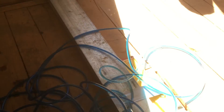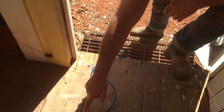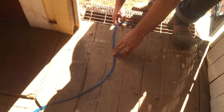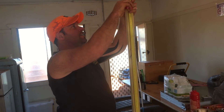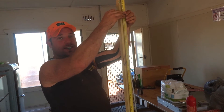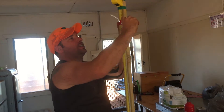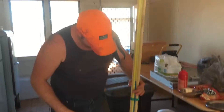Slowly but surely it's running down, running around, and it will keep doing that as long as we're lower. And here it comes now, down the end — you can see the blue coming along, and here it is. So now we've got rid of all of our air bubbles — here comes probably the last one. Let's get rid of that. Now you can see it's a nice thick blue dye coming out. Next thing we need to do is attach this to our staff. As long as this end is higher than our bottle at the other end, we're not going to have any water coming out of this end here. You can put that on in a couple of places.